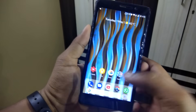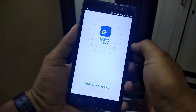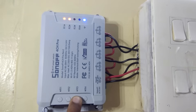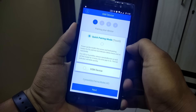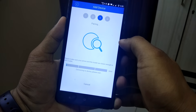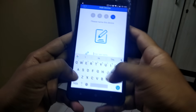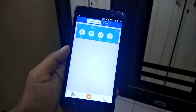To add this device to your phone, make sure you're connected to Wi-Fi and download the app called eWeLink. Register and log in with your account, then power the device and hold any channel button for 7 seconds until the Wi-Fi LED starts fast blinking — this puts it in pairing mode. Press the add new device button, select normal device, enter your Wi-Fi password, and click next. It will take one to two minutes to connect and register.